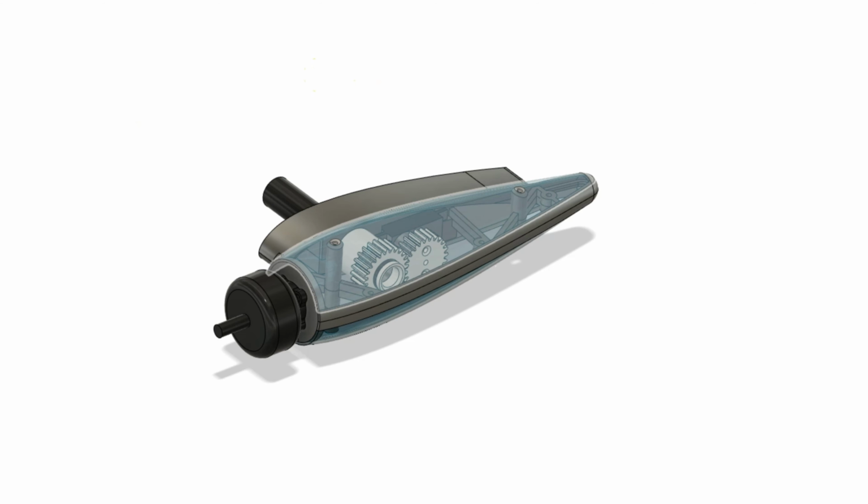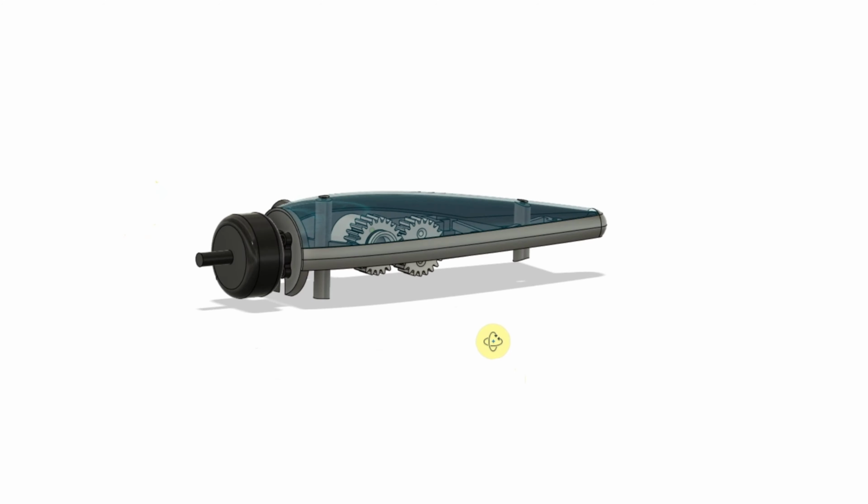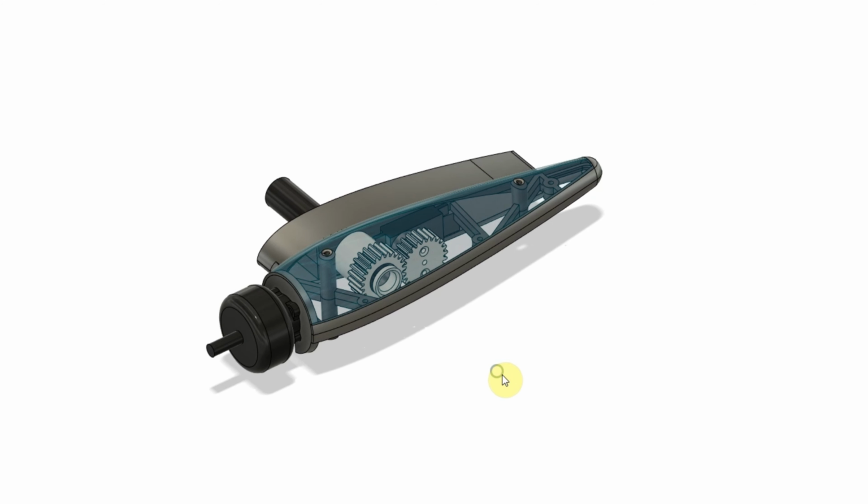This has a top and bottom fairing, and the nice thing about these fairings, I'll turn the top off here on the bottom, is that they can be very lightweight because they're non-structural. I don't have to deal with them right now because I really don't need them for vertical flight testing or even horizontal flight testing until we're really pushing for efficiency. They could be made out of a single wall, very light print, or I could even use vacuum-formed Lexan or a thin one or two layer fiberglass fairing. So it's just for aerodynamics.